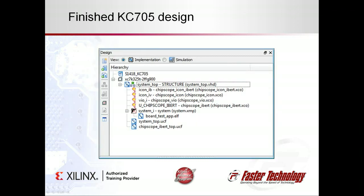Next, we add an EDK subsystem and use EDK's Base System Builder to quickly create the processor subsystem with the appropriate versions of the various peripherals for the target FPGA. After adjusting pin locations in the UCF files, we build the design, export it to SDK, and build the software. We now have a finished design and are ready to download it to our development card.